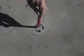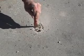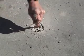If not, drill as many additional holes as you can to the center of the core. This will weaken the core. Then, start using a chisel to break out the core like this. As you can see, our core did not break free, but in a short time, we had our core removed.